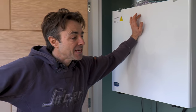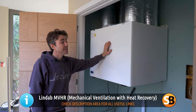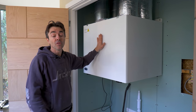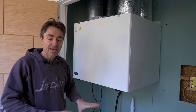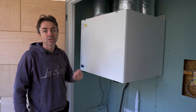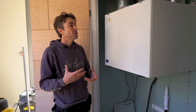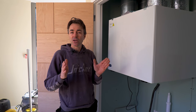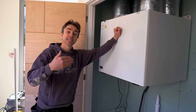The MVHR unit — all commissioned, it's up and running. We haven't got it switched on until we've completely finished with all the dust. What you don't want to do is fill the filter up with building dust — you want to keep everything hoovered and clean before you switch it on. We're being very fortunate that the humidity in the building has remained amazing, it's around about 50 percent, which is pretty much ideal. All this will do is maintain that humidity and ventilation.